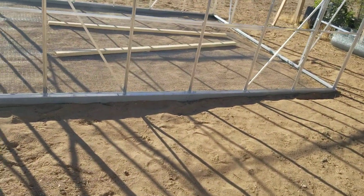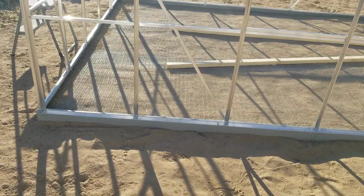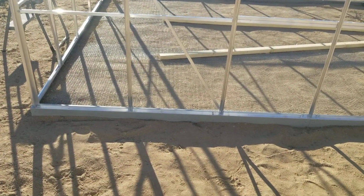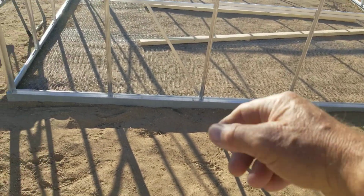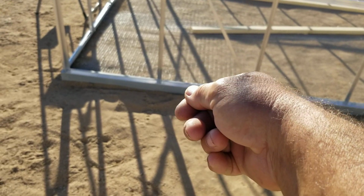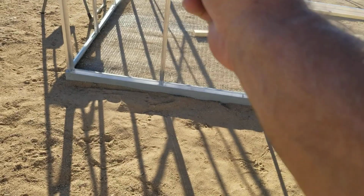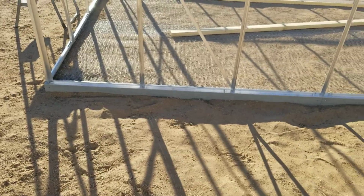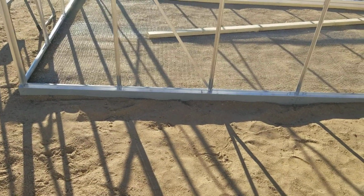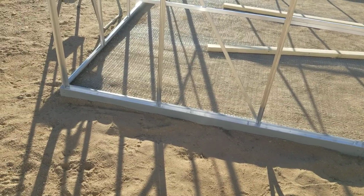Another reason why you don't want to tighten them all at once is because sometimes you have to add something to that bolt down in the instructions. Like all of these bottoms here, when I put that bottom plate on, I had to put the little hold down clips on there. But then I had to loosen those up again to slide these wall braces down over the tops of them, over the top of the head, and retighten them. If I'd left them loose in the first place, I would have saved the step and saved some time installing.